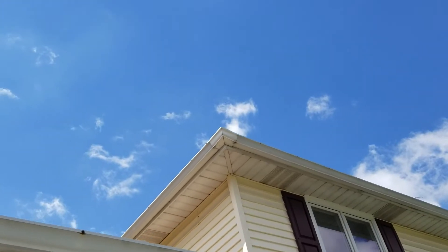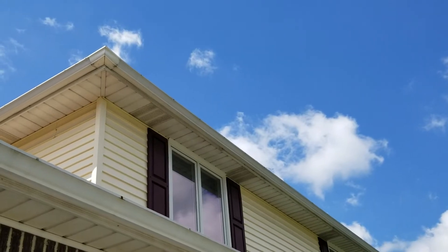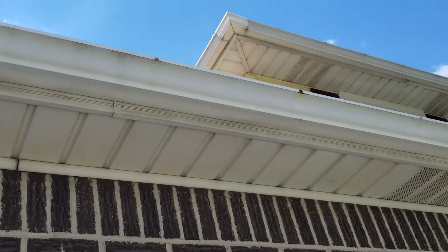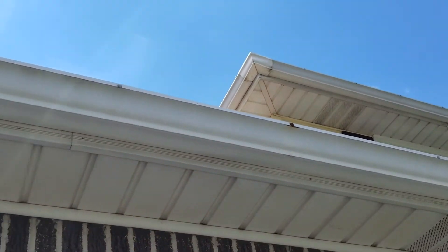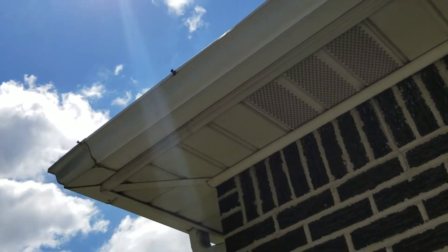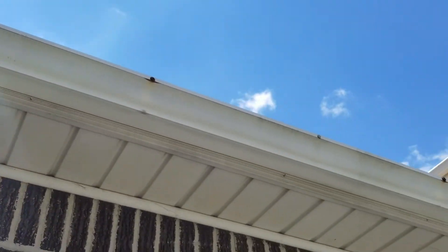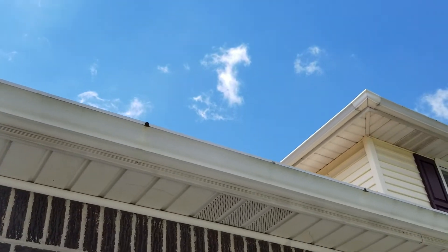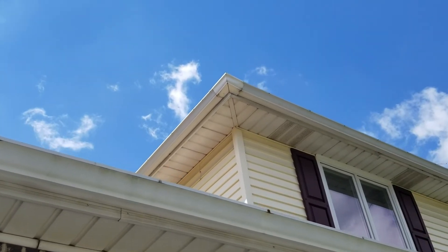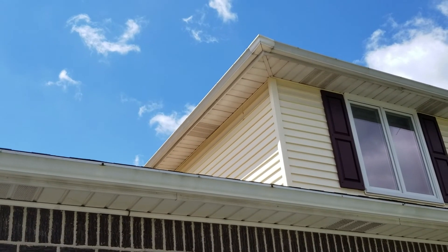This upper miter here is just racked so bad and beat up with the ice. That spike above the shutters pulled completely out and these are rusted. The thing is, you can't put brackets where the old rusted screws are — first off you've got holes on the face, and second off, usually the top of the gutter gets crimped when they drive those in, so your hidden brackets won't grab. So every place in the system is a must — possibly looking at the overhangs too.